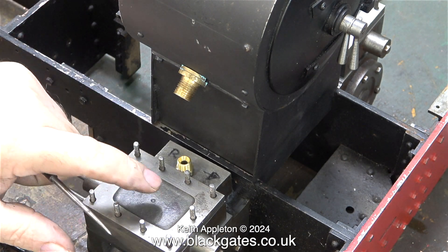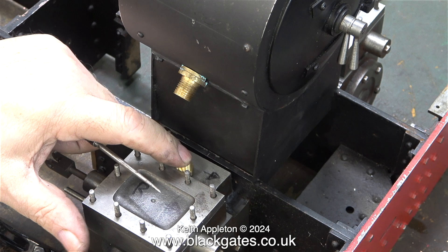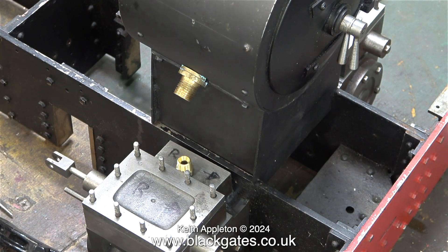In this episode I'm going to look at a potential problem. The steam inlet to the steam chest is drilled in the wrong place and I've currently fitted a 3/8 by 32 union cone into the hole that I threaded. But I can't use this, as 3/8 by 32 is for a quarter-inch pipe, and I need to use 5/16 of an inch diameter pipe for the main steam inlets to the steam chest. Quarter-inch pipe won't pass enough steam to operate the engine efficiently.